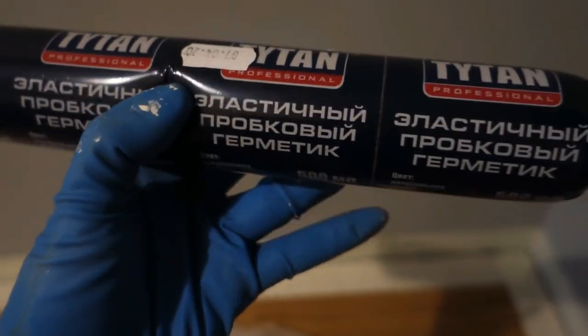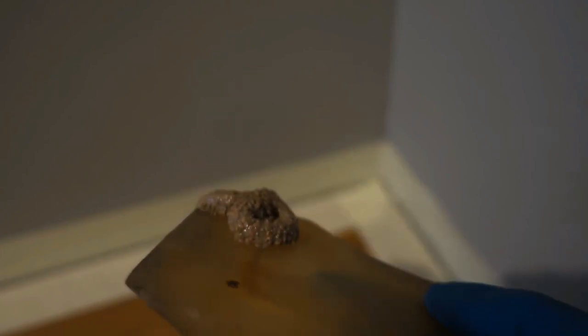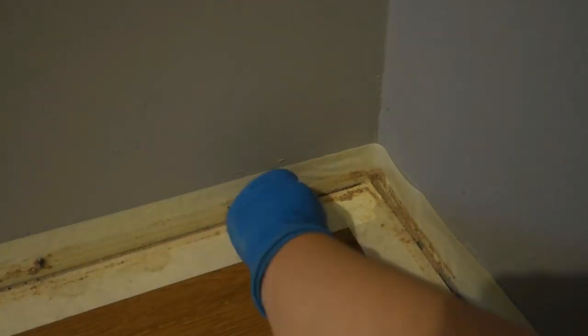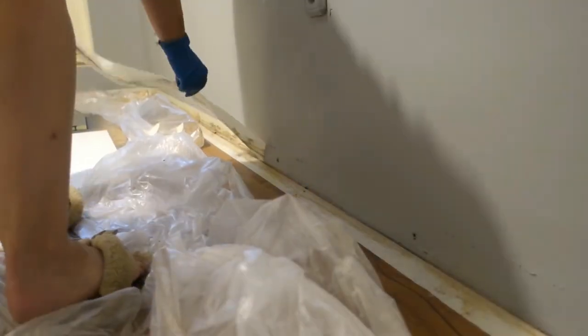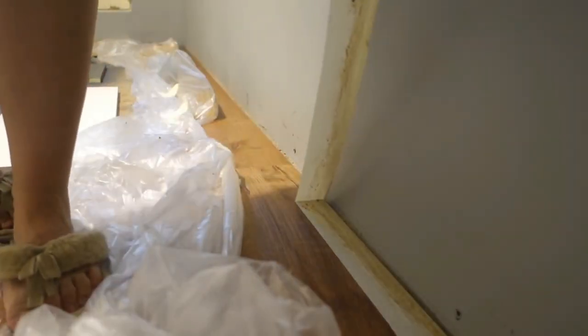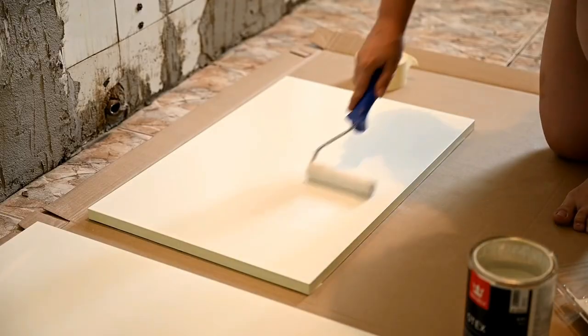As for the moldings, we didn't want to put any molding trim, so I used cork filler to fill the gaps between the flooring and the walls. It's small particles of cork in an adhesive. I cannot say I'm happy with it — it was okay when first finished but it gets dirty with time and you cannot clean it well, so don't do that.